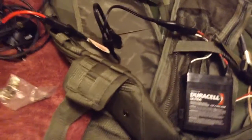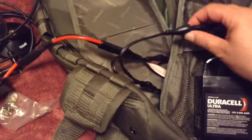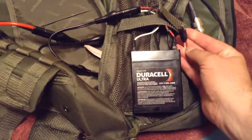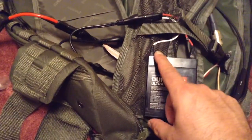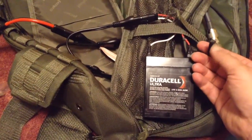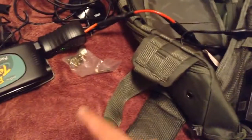With some of these crossover wires you could easily lose track of your polarity, so you look at what's coming and going. The logic on this usually is: if it's a power-receiving device, the red — the positive, the hot — is going to be exposed. If it's a power-giving device or a battery, that is usually going to be the one that's covered up. There is an exception to the rule, and the exception is battery chargers.